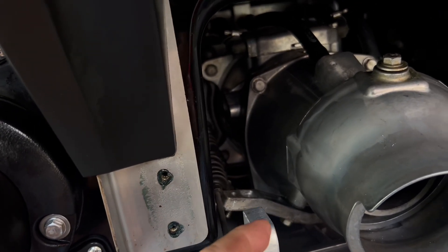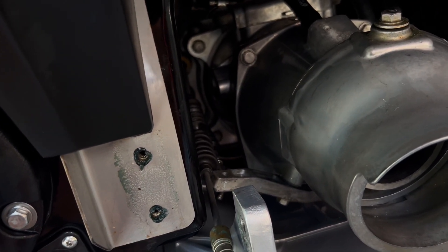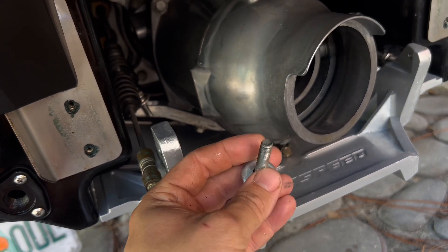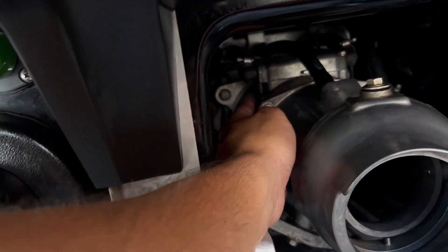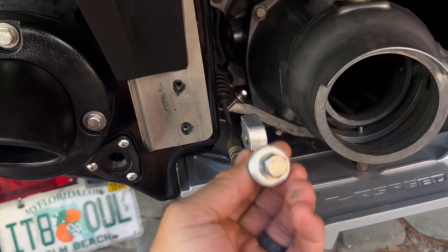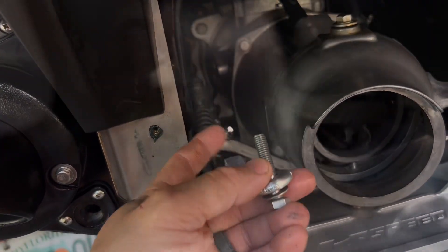You can see I've roughened it up. You want to make sure there's no grease between the pump and the anode — it needs to have a nice, good contact with the aluminum body of the pump. We're going to put that through the bolt just like this. This longer bolt here is about 45 millimeters. It can be as long as two inches — it just comes out the back and won't press against anything. So you can get a 1.75 inch or a two inch bolt; there's nothing on the back, so a two inch bolt would be safe with threads exposed at the back.